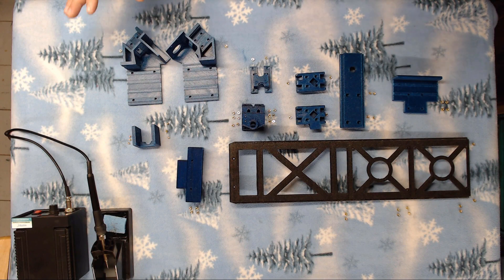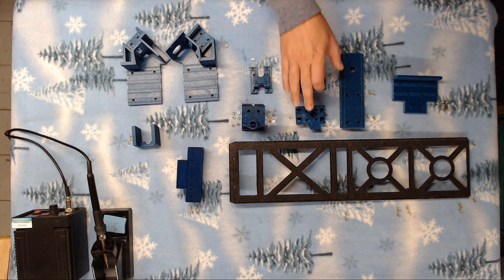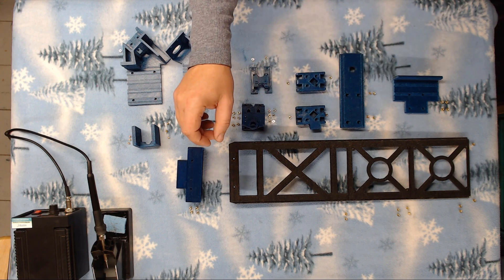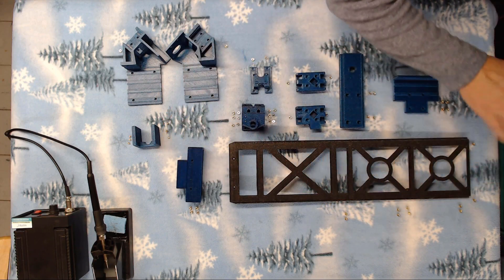All right, so I have all the parts laid out that need heat sets. Each one of your axis stepper mounts takes one for the coaster bearings. The hot end mount takes two. Each one of your X axis mounts takes two. Your stepper mount for your roller takes four. The panel duet mount takes four. Your circuit board assembly carriage takes ten of them.